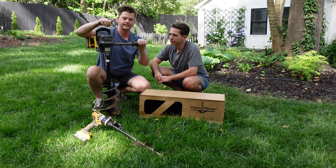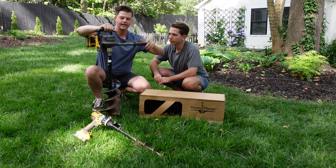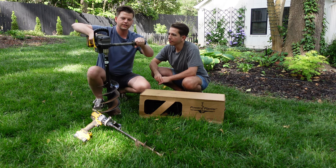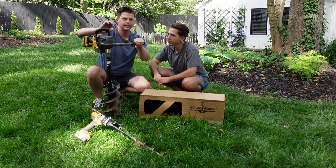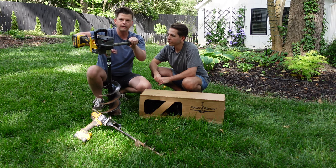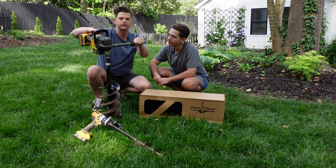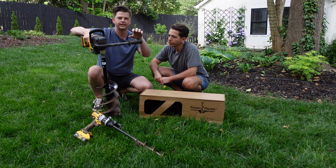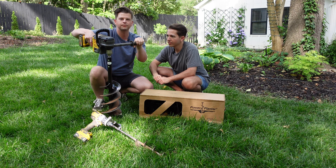I wanted to show the handle on this drill specifically. The smaller drill is a DeWalt hammer drill, and this is a DeWalt joist drill with a handle that screws right into the side. The handle is where you get all your leverage — you hold from both sides and can prop one side on your knee. I actually like the joist drill because it's a bit heavier so you do a little less work; you just let the auger go and it digs a perfect hole every time. Whatever drill you use, make sure it has a side handle for leverage and confidence.